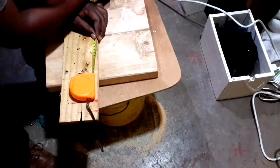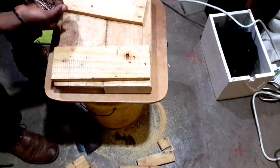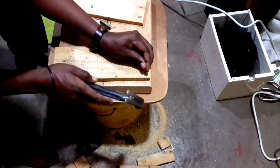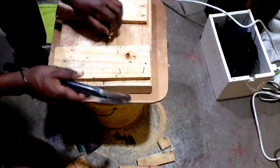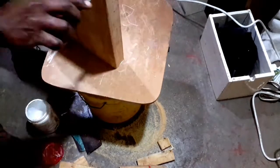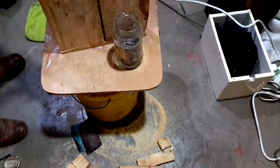Just make sure you get the right measurement and keep everything at a right-angled degree. I normally use screws but in this process I chose nails because the resin will also act as glue, helping seal the wood better — so I opted for the cheaper option. You can get nails at any hardware store. Also remember to add wood glue to enhance the bond.